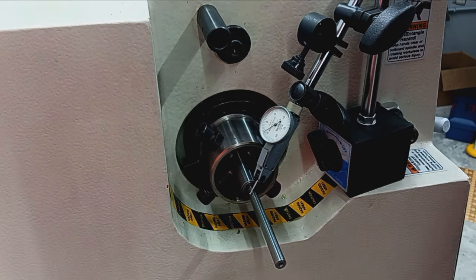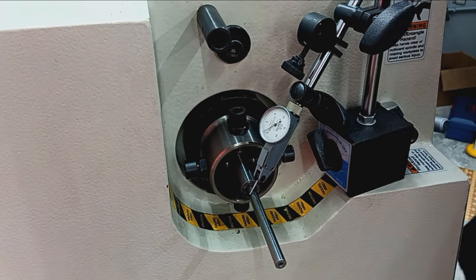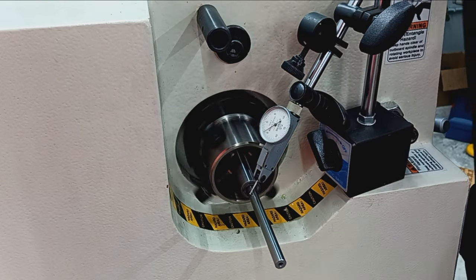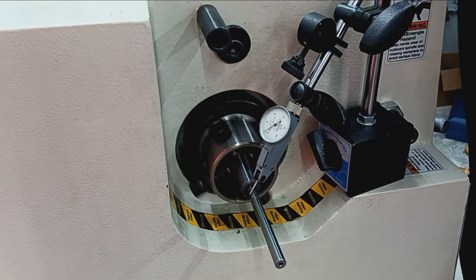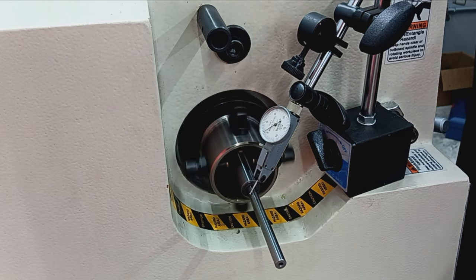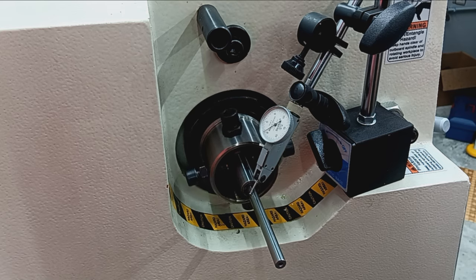So back here at the spider, literally a four-jaw chuck in the back of the spindle bore, with a precisely fit 30 cal range rod with a .2998 bushing. Zero run out.